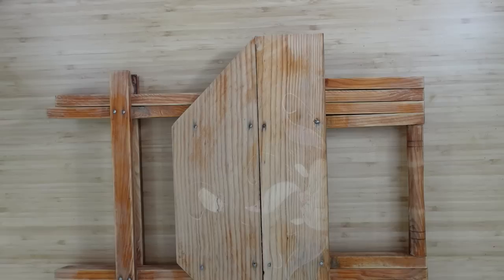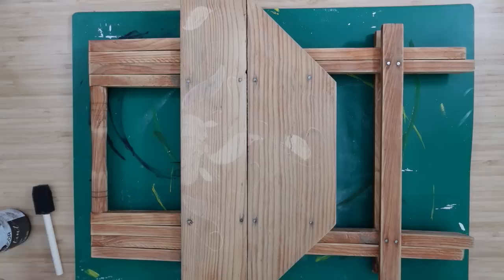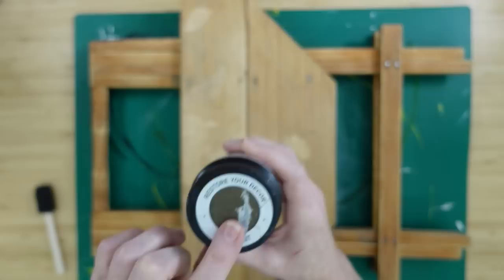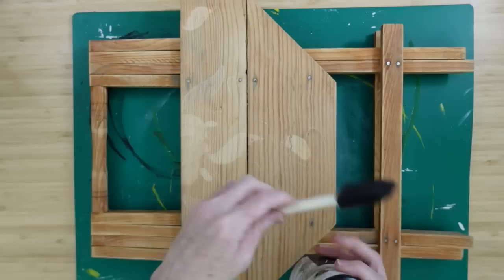When you're sanding and cleaning, make sure you're getting the entire surface — the back, the outside, the edges, the inside, the underneath, the bottom of the feet. Do it all. So it's been wiped and it is dry. Now I'm going to use this wood tint — it's a very dark color, very pretty, and it's going to be perfect for what I want. I'm using a sponge brush and we're not going to do anything with the top — we're going to do everything but the top.